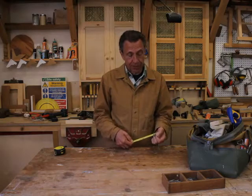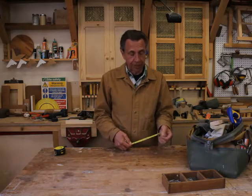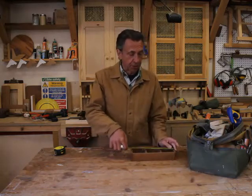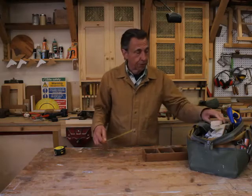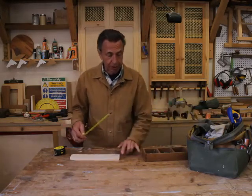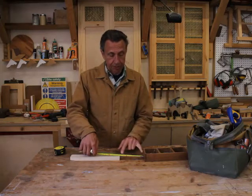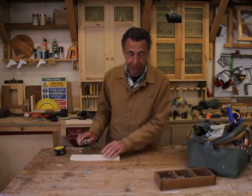They all come with this deliberately, intentionally loose tab that's riveted on the end. This enables the user to make a measurement along the length of something where the tab moves out, and also to make a measurement between two surfaces where the tab moves in, thus retaining accuracy for both operations. It's a very clever thing — simple but clever, like many things are.